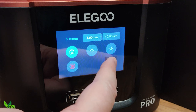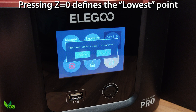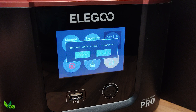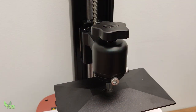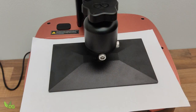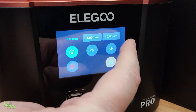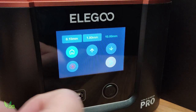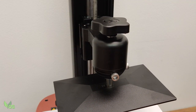Assuming everything has gone OK, hit the little back button and click the Z equals zero button. This sets the height measurement into your printer, so don't forget to click it. Confirmation is generally required, so we'll click that. With some models the plate will automatically rise at this point; in this case we need to do it manually, so we'll select the Move button again, make sure 10mm is selected, and click up several times. The build plate is now levelled and good to go.